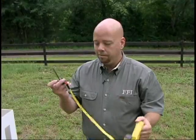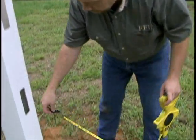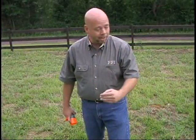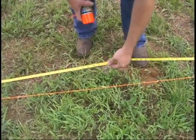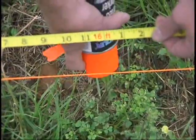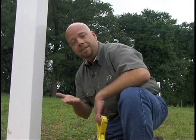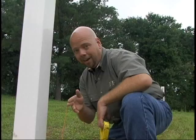We're going to use a standard 100-foot reel tape measure and a screwdriver. Most outdoor tapes have a spot for a stake or screwdriver to hold it down. We put this right here in the center of the post so that is the middle of the rail — it's going to come to the middle of this post. We drag this out to the other post. Since we have our string line and tape measure side by side, we know exactly where to put our fence posts. We reach down, pick up the tape measure, go over to the string, spray directly straight down underneath the string, and mark it at intervals of 8 feet — now 16, and 24. Pull the slack line of your slip knot and it comes off automatically. You can reuse your string because you tied a slip knot, not a permanent knot — if you keep putting knots in your line, sooner or later it will break or won't be as straight as you wish.